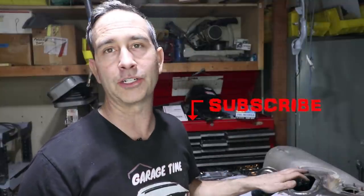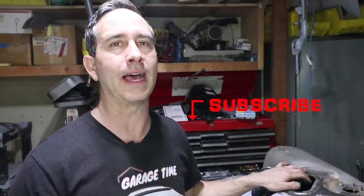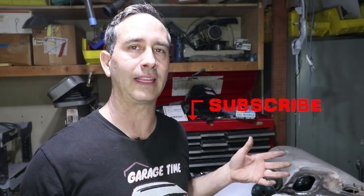Okay, like I just mentioned, this is as far as I can go on the fuel tank today. I sent out the internal parts that I made, the baffle box and the fuel pump hanger. Those are being zinc plated for extra corrosion protection, and they're not back yet. So I can't weld the box onto the bottom and completely weld the bottom in yet until those parts come back. That's important. But I also want to pressure test this. I'm going to rig that up probably tonight with a pressure gauge and see if it leaks overnight.